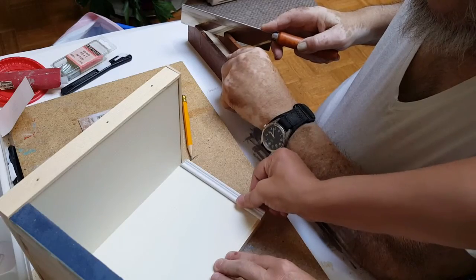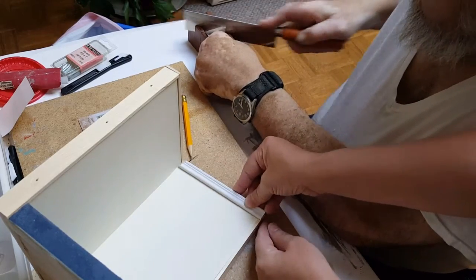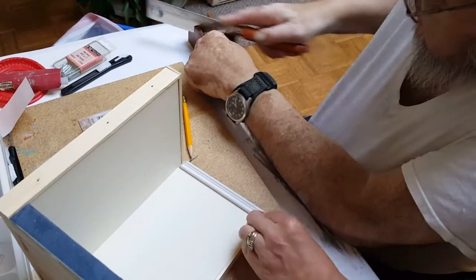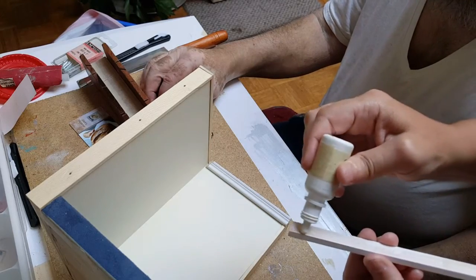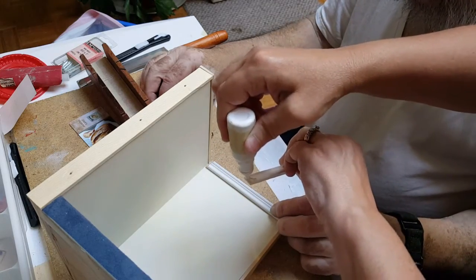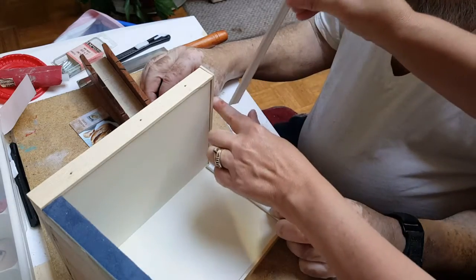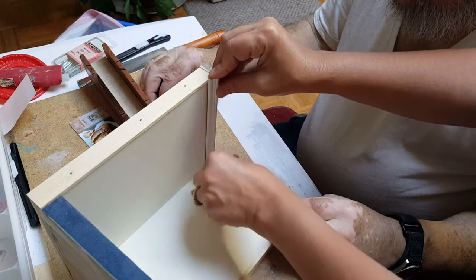If you want to put crown molding up you need to cut it at a 45-degree angle in the corner and flat on the end. You want to cut two pieces to where they meet. Put a little bead of glue along the back side of the top edge, and right where your joint is going to meet put a tiny bit of glue there. We're keeping it with the edge up here so that if I ever want to change the paper out I can.